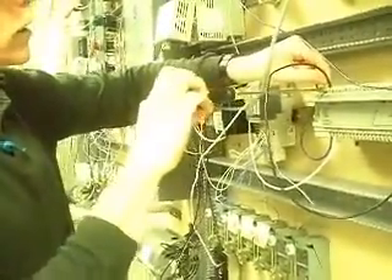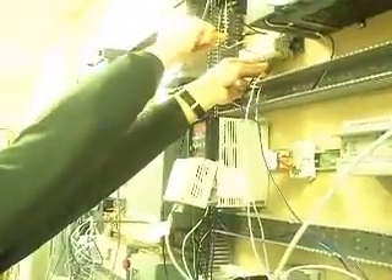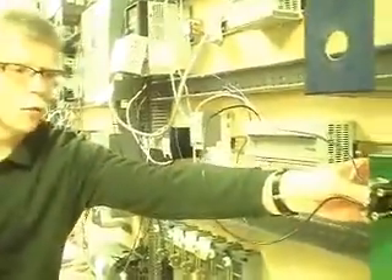Okay, so from common I'm going to go back to neutral, and then maybe we've succeeded. It doesn't look real pretty, but I think it'll do the job. So here's your circuit: you've got hot going to the switch, from the switch going to the input, from the input back to neutral. So when I push this button, because I'm using the normally open contacts, this input should show that it's active. This indicator light should come on to show us that.